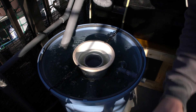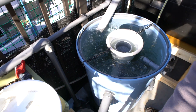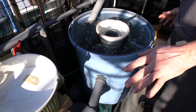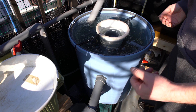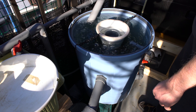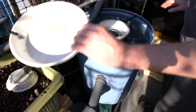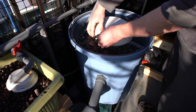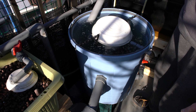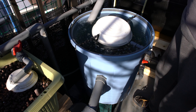There's also the fact that all of this is right next to my bedroom, so even something like this — bring it in close — as this flows, the noise resonates in the large return pipe and you can actually hear quite a little bit of this from the bedroom, which may or may not be desirable. So if you're doing something for home use on your terrace — maybe you want to sit out there in summertime without being annoyed by the noise — there are a few considerations. Stuff like this with an open top: a lot of this will help if you put a lid over it. It will also prevent leaves from coming in. As soon as you cover it, you'll have much less resonating noise, and the same applies to the overflow — covering it up will reduce the noise significantly, though you do need to have air going in.